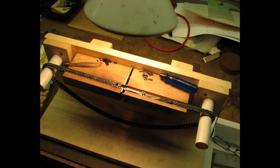Again, cleanliness and tension are critical, such that we produce the right length band. One of the problems is this. If you make a band and you can't get the last slug into its slot, the band is no good. If you produce it so it's too long and there's a gap between the last slug you put in and the first slug you put on, then you also have a problem. So the band length is very critical to having a decent band ready to use.